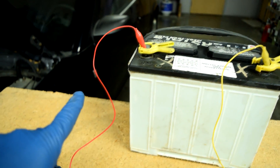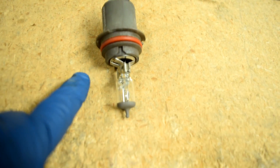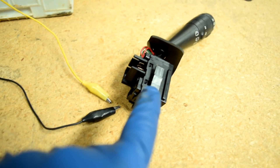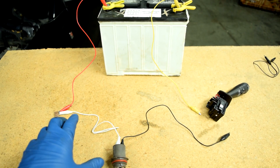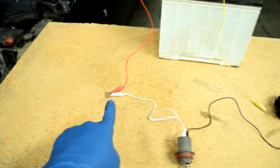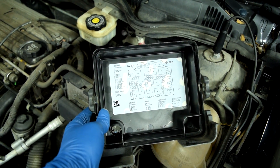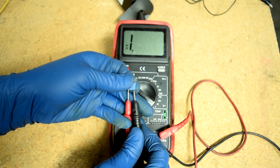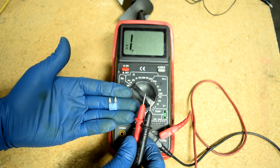Here's a little mock-up of the circuit we have on the board. There's a battery, there's our positive side, there's the wire for our fuse in the fuse box, from there another wire to our headlight bulb, and here's the ground wire for our light bulb that goes to our headlight switch, and there's the ground wire that connects our switch back to the negative side of our battery. The easiest thing we can check on this circuit is to obviously check our fuse. Go to your fuse box under the hood, look up the correct fuse for your headlights, remove the fuse for a close visual inspection, and you can do a continuity test to make sure — just make sure you're not doing a continuity or resistance test on a hot circuit.